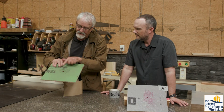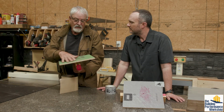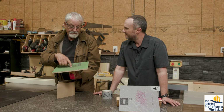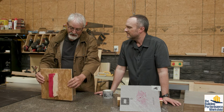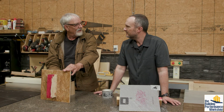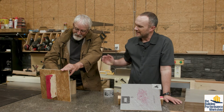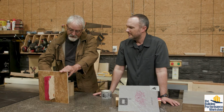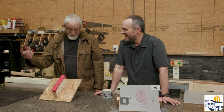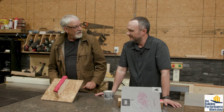Now that we've overdriven the nail, you could see there's lots of voids in OSB that allow moisture to move through, and you've just blocked that up right there. So anytime you overdrive a nail, if it's going to get a lot of water, say it's behind brick, it will. Just imagine if you had that up on a wall and you had a brick tile right here and an overdriven nail right underneath it, and you had mud that came back all the way, because that'll be what happens. Every time it rains outside there, it'd be constantly wetting that right there. Like a hamster feeding water bottle. Yep. I've never had a hamster, I'm pretty sure that's how it works. When the rain quits and the sun comes out and it hits that brick, it's driving that moisture in.